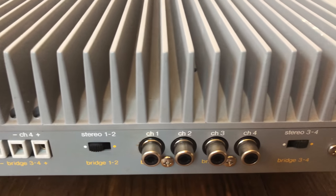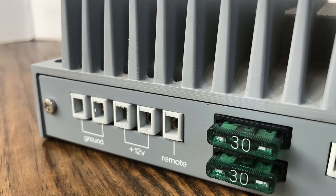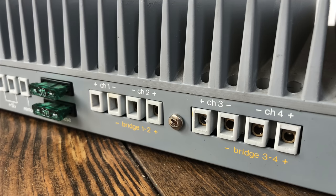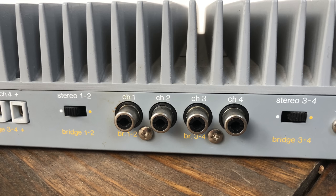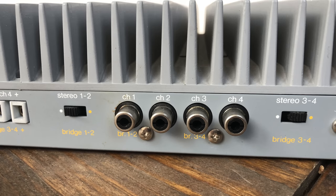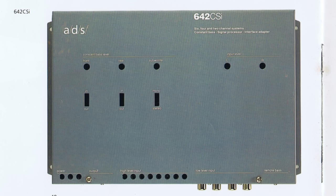The way all the connections happen on one side helped for a really clean install. You'll notice the dual ground and dual plus 12-volt inputs, a remote insert, and dual 30-amp fuses. All channels individually had their own insert terminals. The bridge diagram shows how to hook it up — there's a switch for bridging, and you use RCAs 1 and 3, switching it to the right to the little yellow dot.